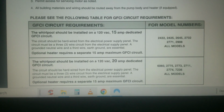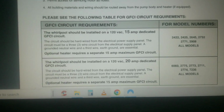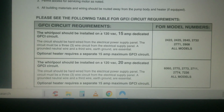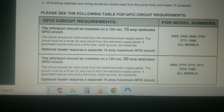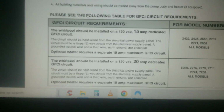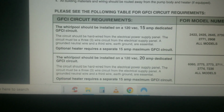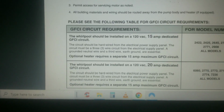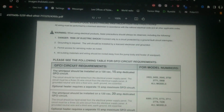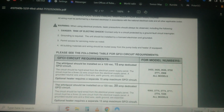But if you don't have this done, just keep in mind your water lines underneath in the basement, they're close to leaking right now. There's YouTube videos on it. But when you don't solder those joints correctly, you use too much heat, too much flex, when the water flows past it creates a hydrodynamic deal, and it causes pinholes. And that's what's happening, and that's why it's turning green. I'll see if I can find that video and you'll understand a little more.